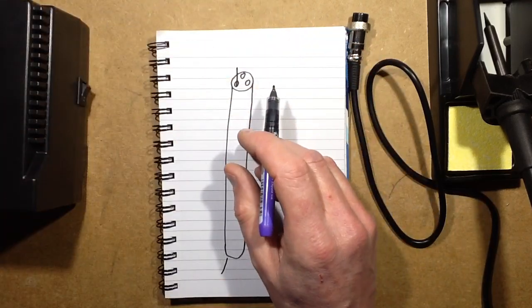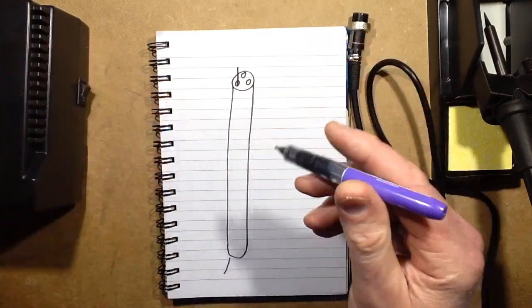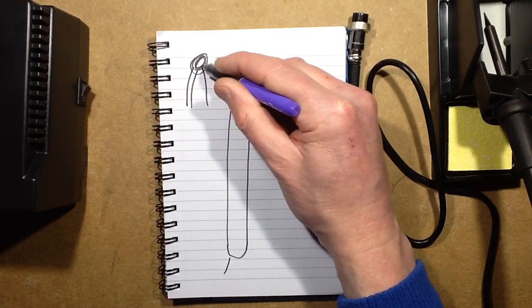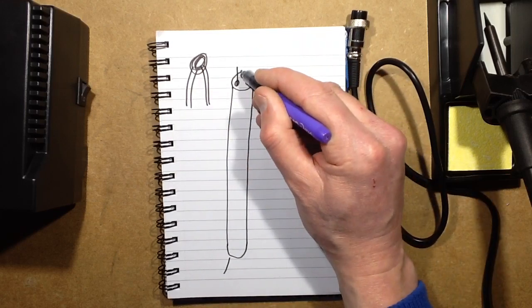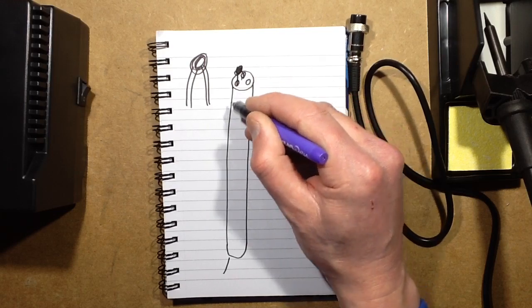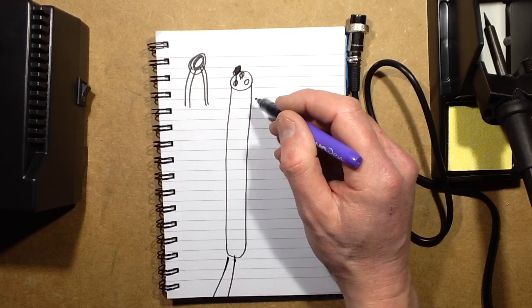Oh, where is it? Here it is. This is a thermocouple. It's basically a junction between 2 metals, with the 2 wires just joined together at that blob. That's what this thermocouple is. There's a little thermocouple blob, and then the 2 wires going down inside, and they come out the bottom. So that's the temperature sensing dealt with, using 2 of those holes.